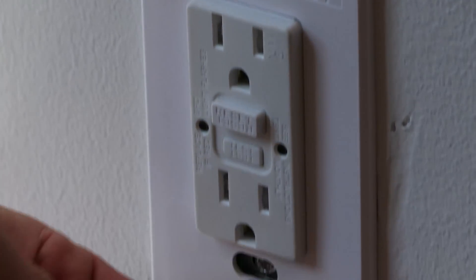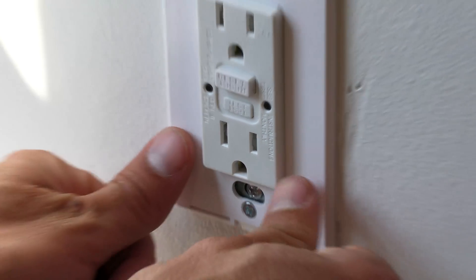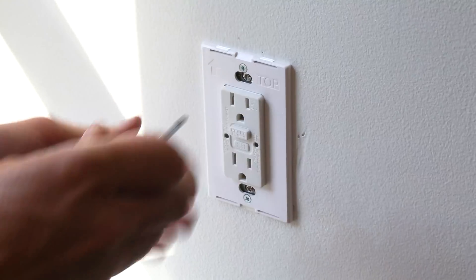Before I get too far, I'm going to open my screwless plate and make sure it goes on once the GFCI is fully seated and not before. It's got an orientation — top and bottom — and in fact it does. Take care to put my GFCI in a true vertical. If you don't have a good trained eyeball, then put a level on that — dial it in, no excuses. A couple of turns, take it easy; this is easy to strip out. A nice flush fit.